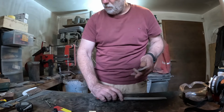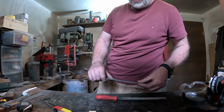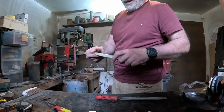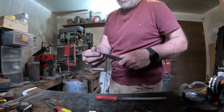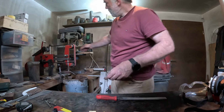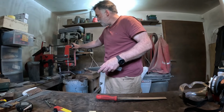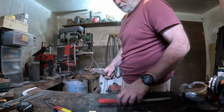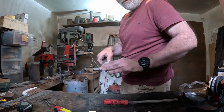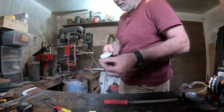A little bit about the grinding process. What I used is a 40 grit, or it's 39, I'm not sure, ceramic belt. This one is already used, because I like to take as much material off as possible before heat treatment, this is how I can use all my belts completely. So typically the new belt, the lower grit, will be used for final flattening of the heat treated knife, making sure all my flats are really well flat.